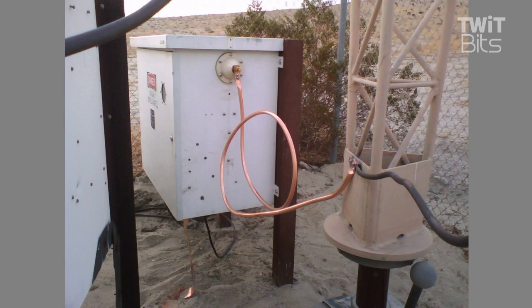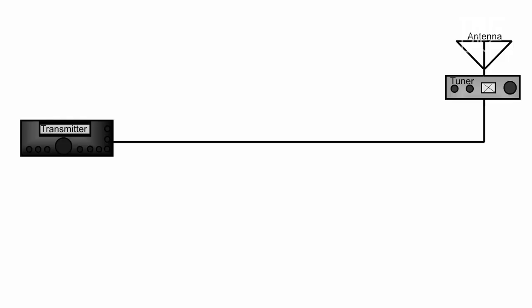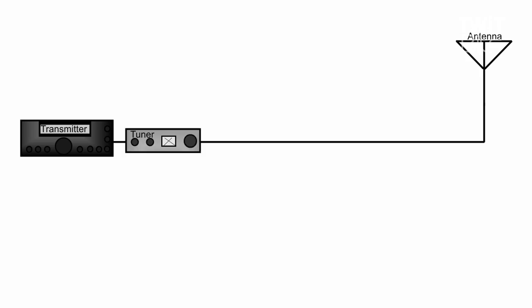There's no changing. However, with amateur radio, it's often not practical to put the antenna tuner unit right at the base of the antenna, so we'll move it inside the shack near the transmitter. Now, this is a compromise — not the best way to work, but it's what most of us do who are using a tuner. Our transmitter will be perfectly happy operating into a properly tuned antenna tuner that'll present 50 ohms to it. However, there's still going to be some reflected power on the coax, and that's not good, but it's what we live with. This discussion could go on for days, but we're going to stop it here so we've got time to talk about some of the other items that you might want to put in series with your transmitter and antenna.